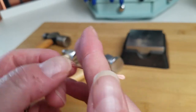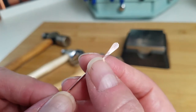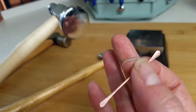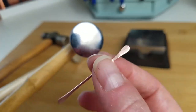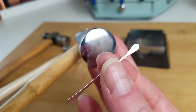But if you want more refined finishes, you're going to get that with a true jewelers chasing hammer. Now notice there are some faint tool marks on this paddle — that's going to happen because of this rounded surface. I used this three ounce hammer to make this paddle from 16 gauge wire, so you can see it will paddle 16 gauge wire with no problem whatsoever.